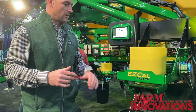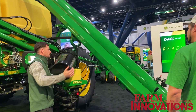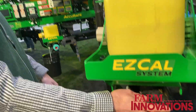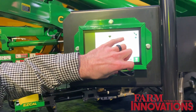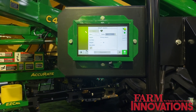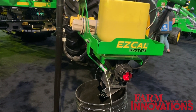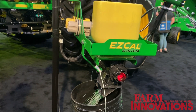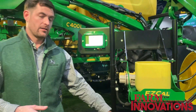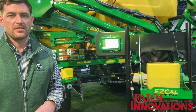I am now in front of the EasyCal display. This display simulates what an EasyCal would look like. You fill your bucket and put the product in there — we had already done that off camera. You'd select what roller you have in; I have a black roller in, so black is already selected. Then you select which tanks you're going to calibrate, and hit the start calibration button. It does two meter revolutions to make sure the meter is primed, then continues running to ensure product is flowing. It's weighing the actual hopper, so it doesn't matter if it's swinging in the wind. When it's done running, it'll spit out an MDB value and send that right to the cab.